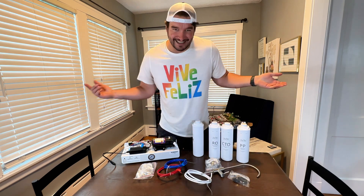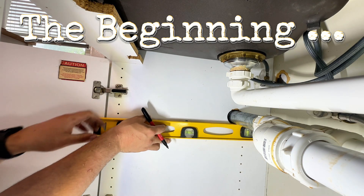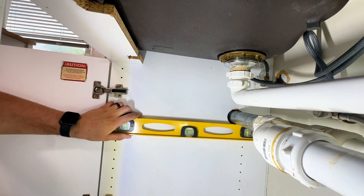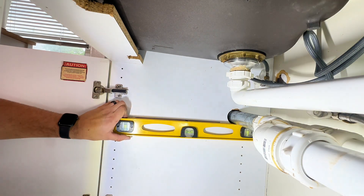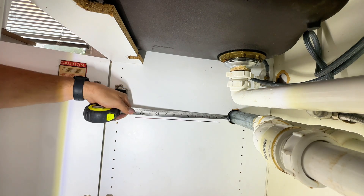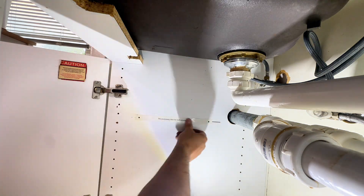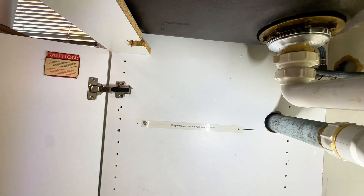Let's put it in. The first thing we're going to do is figure out where you're going to put it. The dimensions are 15 and a half inches wide, and you'll need 15 inches of height clearance. There's a lot of stuff going on under my sink, so this is the wall I'm putting it on. I just took a level, drew a straight line, and measured over on the bracket to see that the first screw was three inches over. This sticker comes with the kit — put it where your mark is, then put the two screws in that are going to hold the whole assembly.